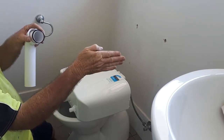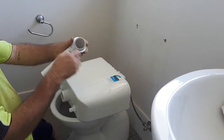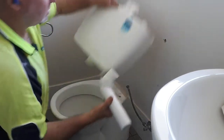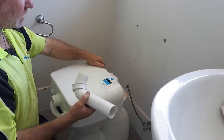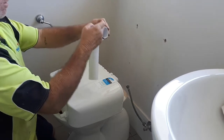If you've got the rubber that tapers from the thin part and goes up, it starts thin and then goes out and comes to a flat end. That flat end goes downwards, obviously, and the nut goes on. The taper part goes up because this is going to sit up into the housing. Make sure you put the start of the taper upwards and just roll it on.